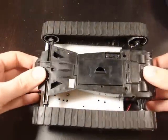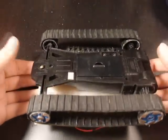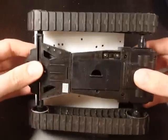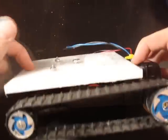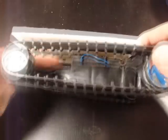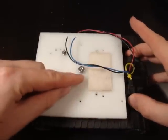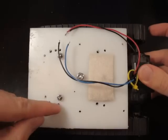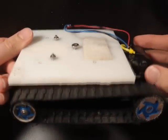I'm going to show you how to attach a motor driver and an Axon to a typical RC toy. This is an RC toy I bought years ago for about 15 bucks. I took off the top and what you see here is a plastic plate. I just drilled some holes in it and screwed it into the plastic. This plastic sheet also has various holes drilled into it to attach my electronics.